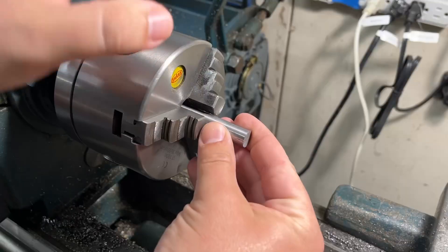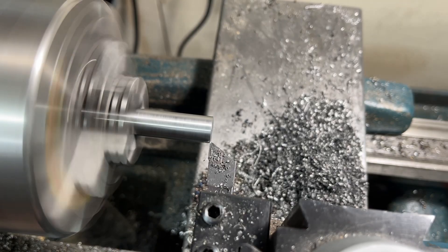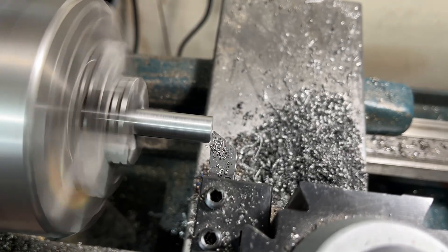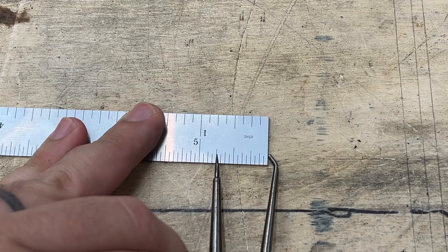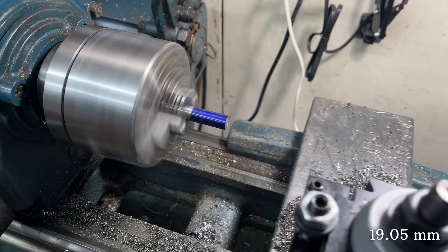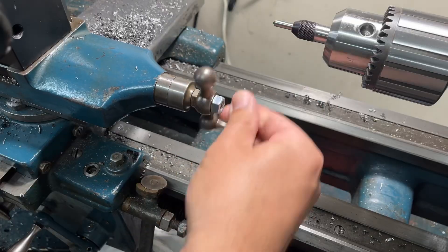Setting the cap aside, I can mount the second section of iron in the lathe to make the cartridge keeper. I designed the taper to end at this shoulder here — it would have been easier to just have the taper go all the way to the outside of the keeper, but I think this will look better. The tapered stem will end up being about three quarters of an inch long. To make sure I don't machine away too much material, I use my edge scribe to mark a line three quarters of an inch away from the end of the bar. Now I can start machining the taper, making sure to stop just short of that line.